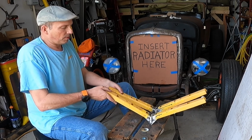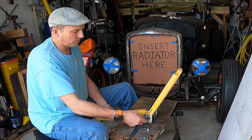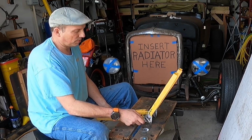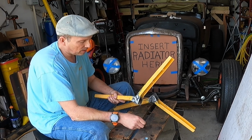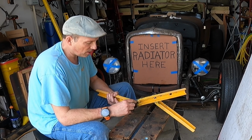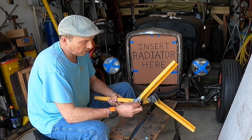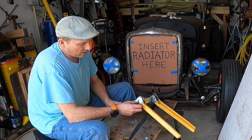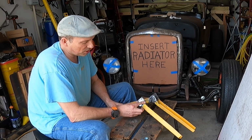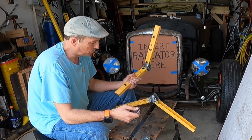This is going to be my foot pedal, like that, tied together at the ends here, pivot through here. Now, because my pivot point is right on the seam and the welds here, I'm going to have to drill this for an axle to go through it. I'm going to take these heavy duty washers and weld them onto the pedal on both sides here, and then drill out the center, and that way this will be reinforced where I'll be putting pressure against it. Make sense? Hope so.